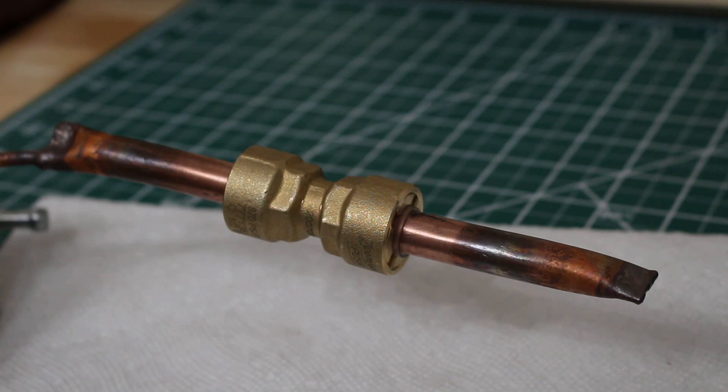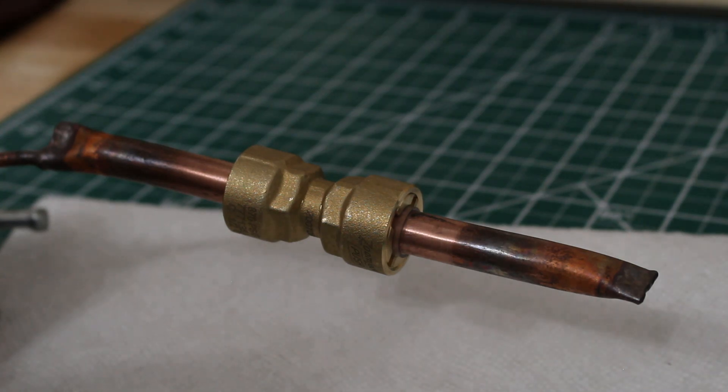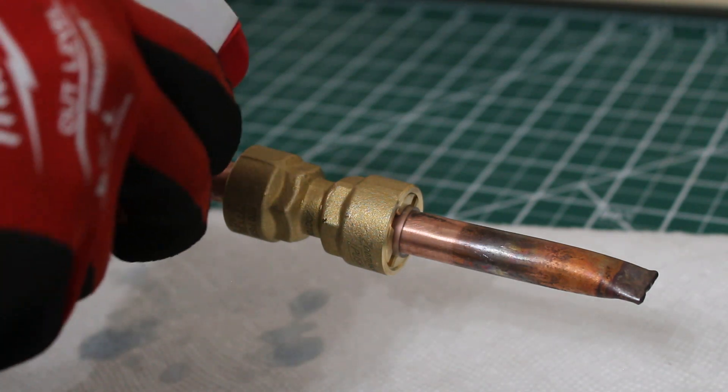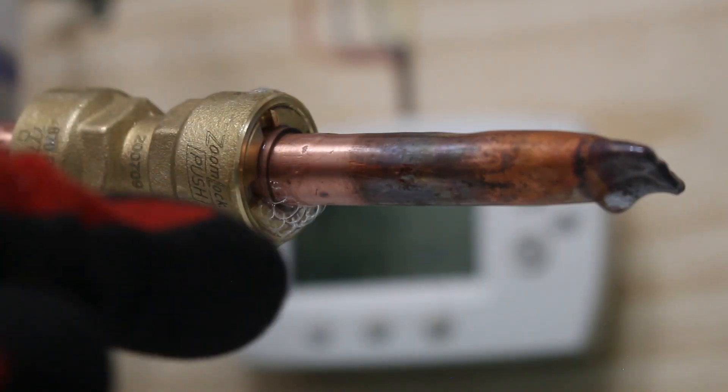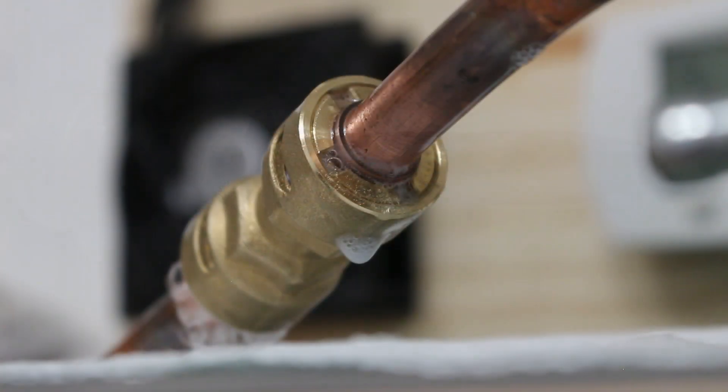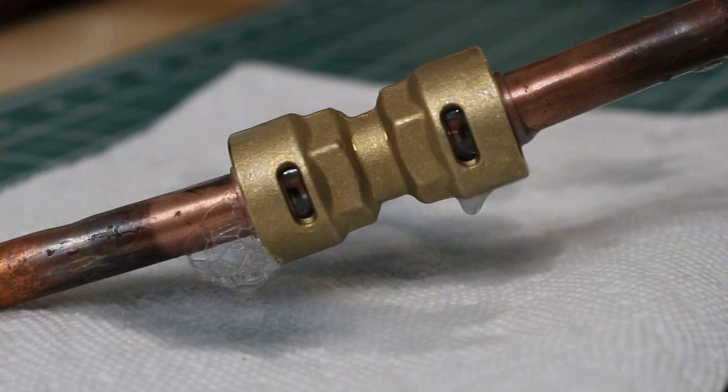It took as much as it could take — we got about 490 PSI. Let's go ahead and spray some leak check on here. We actually do have a small leak right there. Here's the other side of the fitting, and this doesn't appear to be leaking. You can see the clear difference — the left side is clearly leaking, the right side is not. To me, I wouldn't say it's exactly the fitting, but it might have been the preparation.